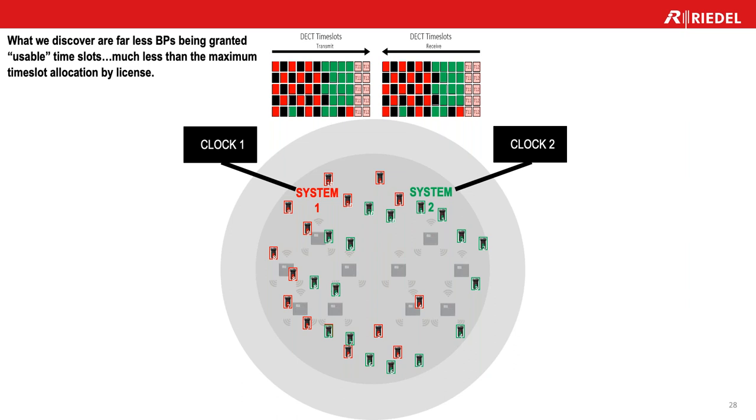And I think we talked about this question when you were sequestered and not here. If we're back to the question another person asked: if the perfect storm includes products like FreeSpeak or Romeo in the same area, and you want to use 50 belt packs, how affected will Bolero be with the other system being there? Or do you have to also count the other devices in your 50 count? You have to cumulatively count all of the radiating devices.